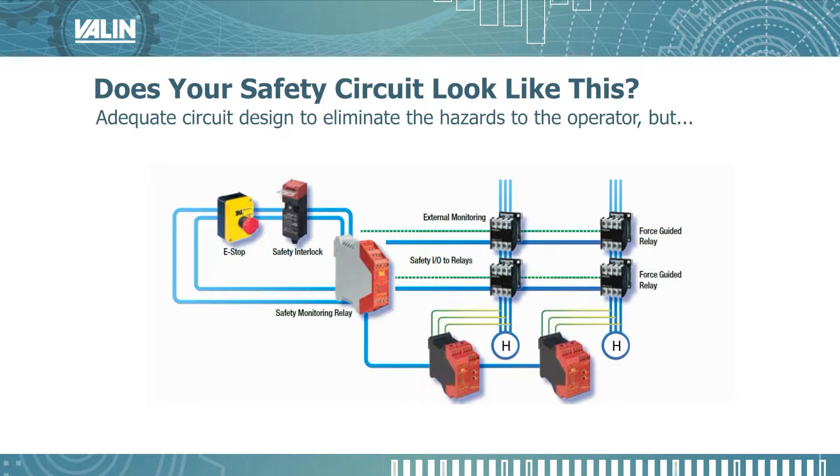Once you overcome that hurdle and you're actually in operation, the system will work well. But during the maintenance phase, they have to do maintenance on the machine while it operates, even if it's at a lower speed. A lot of times what you'll see is they'll take the key or have an extra key for this safety door interlock and stick it in there so they can operate the machine with the safeguard disabled. Sometimes operators will get the idea that it's a good plan to just defeat the door interlock so they can work more efficiently. This shows another weakness: we don't have the ability to use the safety monitoring relay to go into another mode — all we have is the safety mode.